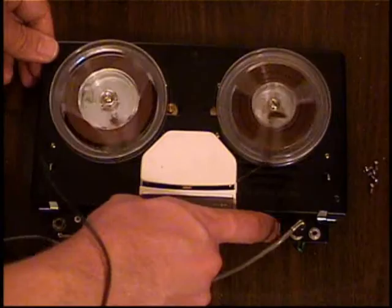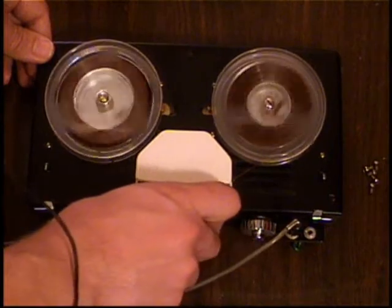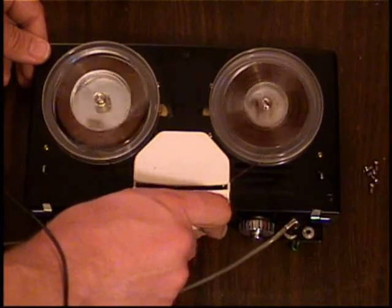Doing some recordings in which I will adjust the bias resistor whilst recording. I affixed a trimmer in here, turning it up. I have the level set too low. It's going to be a very bad recording.